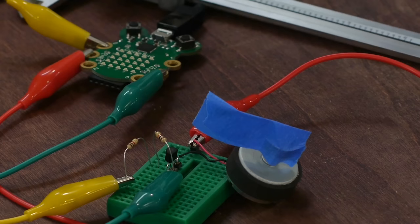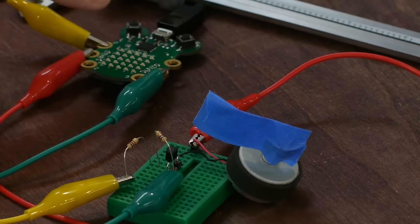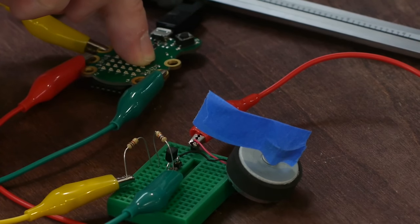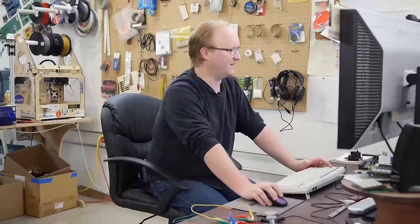If you have a floating voltage — if the base isn't connected to anything — it will still stay off. See how it's not doing anything? But if you apply voltage, the motor will activate. Basically a pull-down resistor ensures it stays in a known state, because you don't want it to be on unless you actually tell it to be on. So on the Code Bug we have ground, power, and our signal on leg zero. Here's a good example of why you might want a pull-down resistor — when you reset the Code Bug, it's going to boot in an unknown state, which means that pin could be floating, and then the motor would boot up.